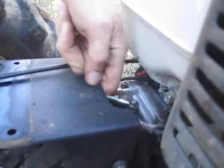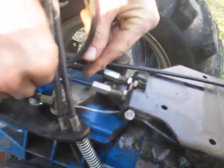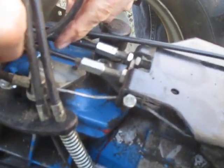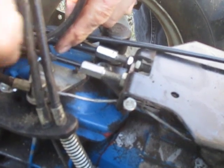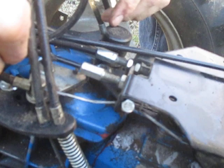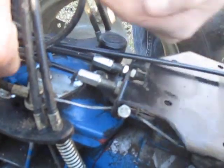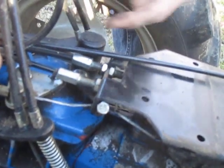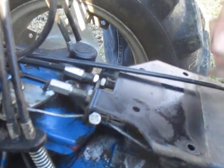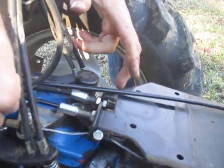This is the end of the cable. You can see the wound steel part of the cable and the eyelet at the very end. You can see how much slack is in this cable because I can move this sheathing in and out — I shouldn't be able to move that sheathing this much. Anytime we want to tighten any cable, the sheathing essentially has to be pushed back away from the anchor point of the cable in order to take the slop out.